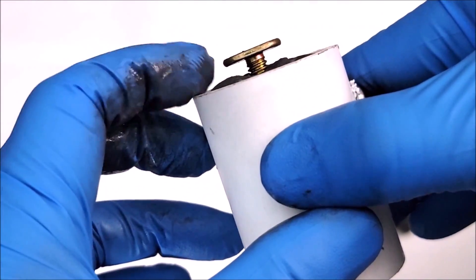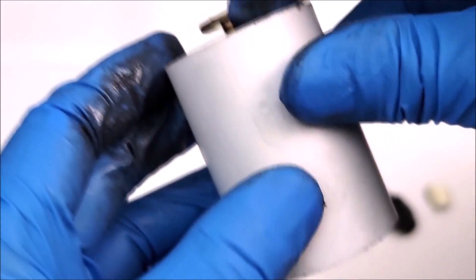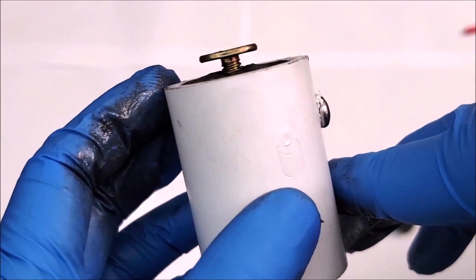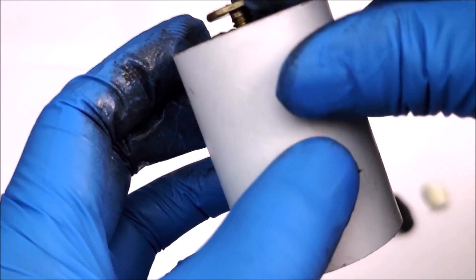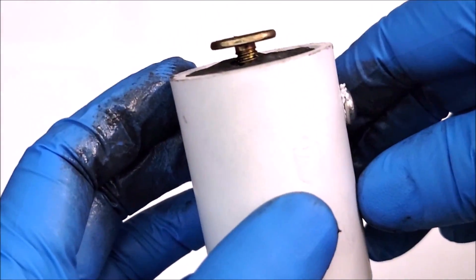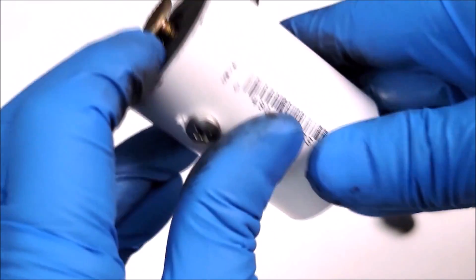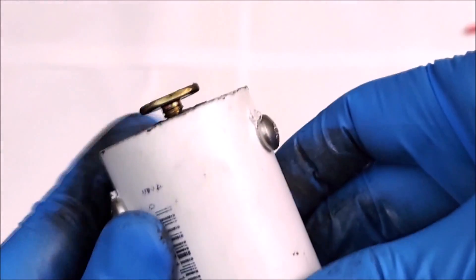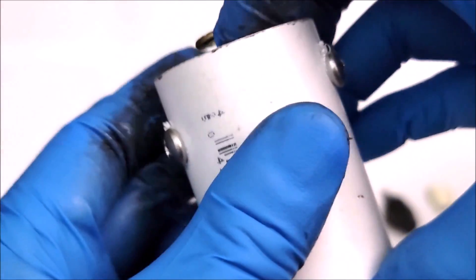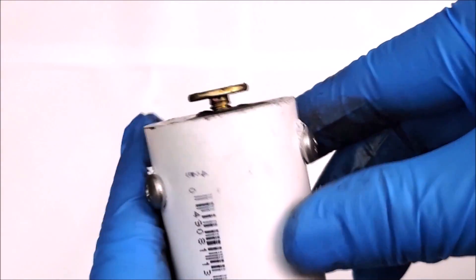Check the bottom and make sure there is no epoxy protruding above that surface. If there is, use your finger to try to flatten that out. Depending on which epoxy you use, you have between five and ten minutes to work with it before it hardens — once it hardens you really can't do anything. Work fast. The epoxy does generate a little bit of heat, so try to get that base foot kind of flush and flat.